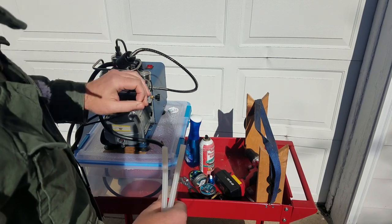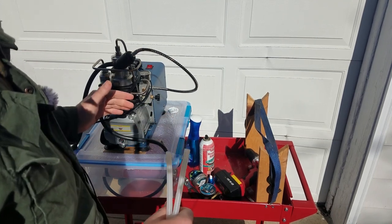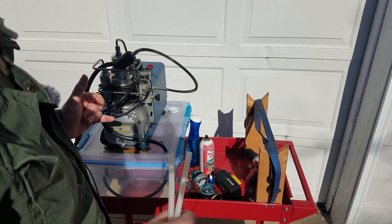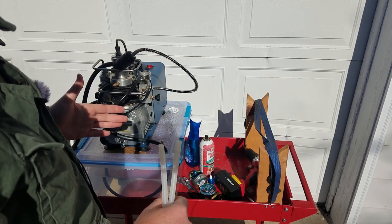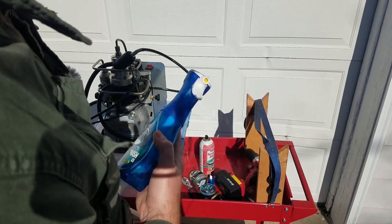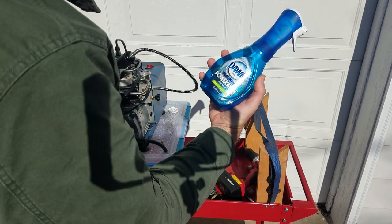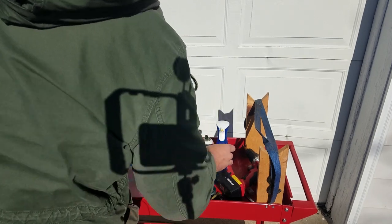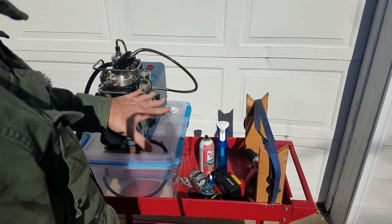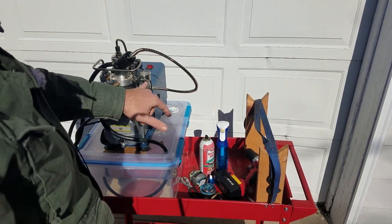After six months, make sure all fittings are tightened. I've had some fittings back out a little, so every other session I go through with a hand wrench and tighten everything. I don't want any leaks while trying to air something up. To find leaks, you can use hot soapy water — I used dish soap like Platinum Power Wash, which bubbles up really well and shows you exactly where it's leaking.